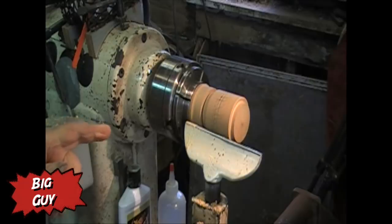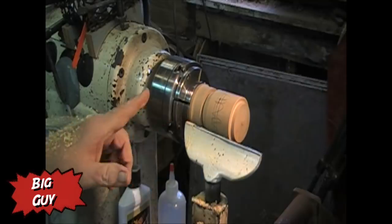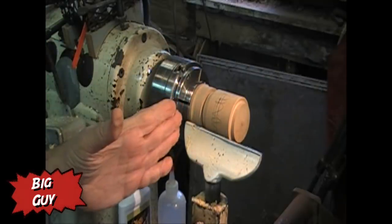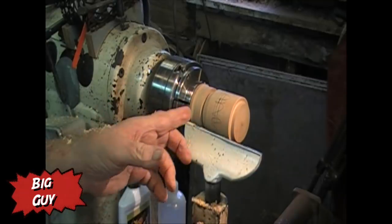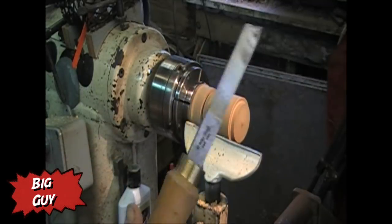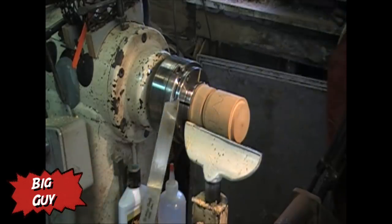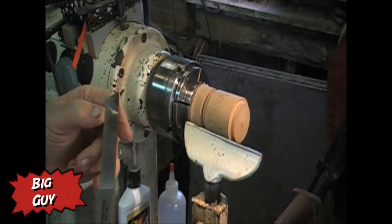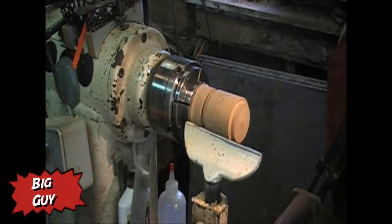Now I get guys — and gals — asking me: would I take my saw and finish this off? No. Right now I've got a super clean smooth surface here and a fairly smooth clean surface over there. I'm going to part it completely off using the parting tool. This is from D-Way Tools — see the name on the side? It's made here in the USA and it's really good. It's a simple sharpening trick to point up that thing — all I do is take my diamond stone and stroke up, put the burr back on it. That's what does the cutting.